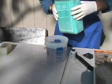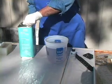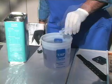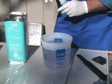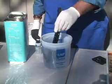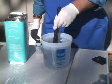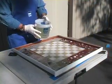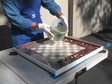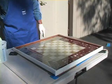Mix the resin and hardener for the next layer as before, except use a little less hardener, since the first layer will generate heat, which will accelerate the cure of the second layer. We will use 3 drops per ounce. Again, your project may require a different amount of catalyst. It can't be emphasized enough that experimenting is essential to learn the behavior of the resin for your application. Pour the second layer to the desired height and allow it to gel. Again, we waited about 1 hour.